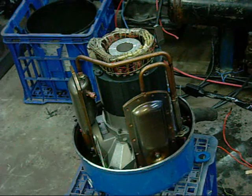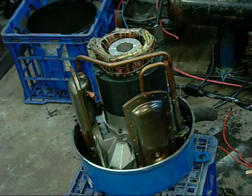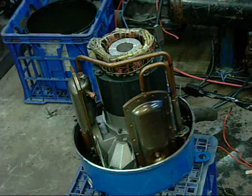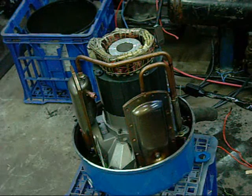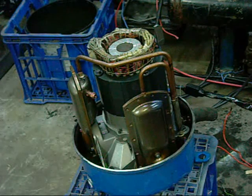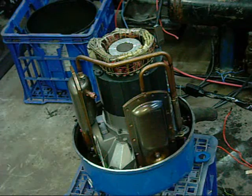I got her unfrozen again. I poured a lot of antifreeze down the centre of the rotor to cool it off — it was boiling hot, well over 100 degrees Celsius. I think the main bearing seized up; that's how most of these compressors fail when I try and blow them up, which isn't the first test I've done. Now it's got a bath of antifreeze, cooled off, and ready to run.